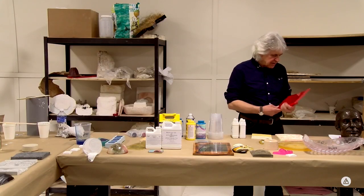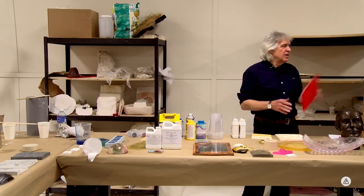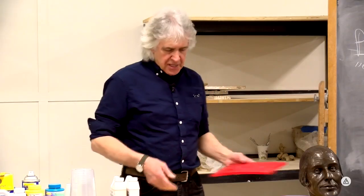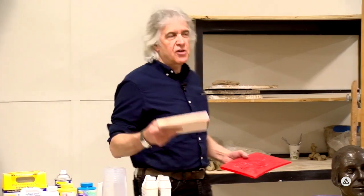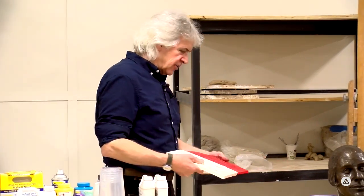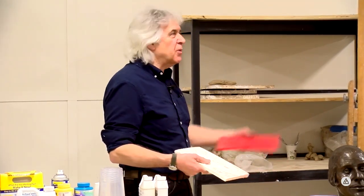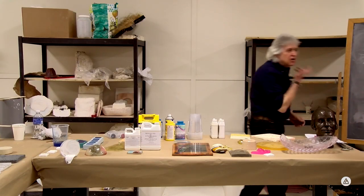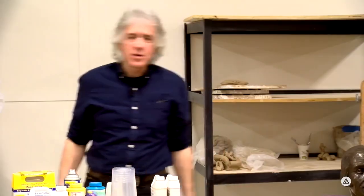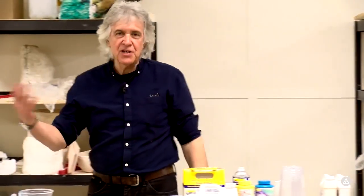Here's the same type of resin with a dye added to it. The interesting part about this is that if you look at an opaque version of the casting, you can see the image very readily. If you look at a transparent one, it doesn't show up so well, but when you hold it up to the light, it changes it dramatically. So, sometimes you can use the angle of viewing along with whether or not the light is passing through a surface or from the front of a surface to alter the way an image looks.